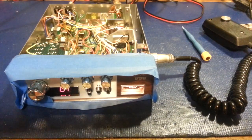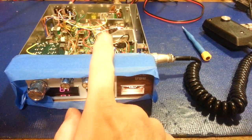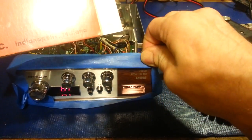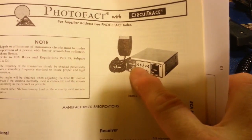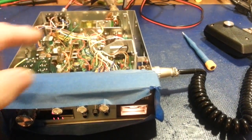There's a little trick to that with these chassis. Once I got into it I was like, aha, this is one of those — don't go 100% by the alignment procedure. This model radio, Sam's never made a specific service manual for this exact radio. But this radio uses the exact same circuit board that the 305 did. This is a 304. The 305 uses the same chassis — the only real difference is it has a couple extra buttons. Same amount of controls, just a few extra buttons. But if you follow the alignment procedure in this book, you're not going to be able to do this. We have the exact same setup.